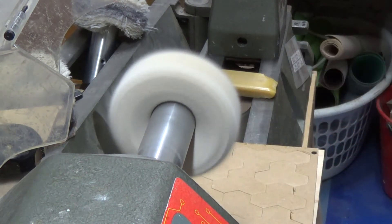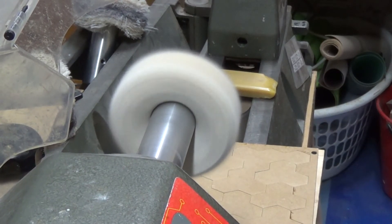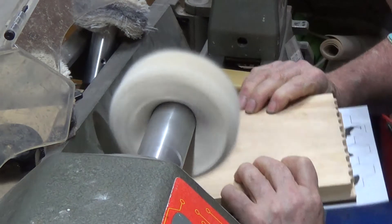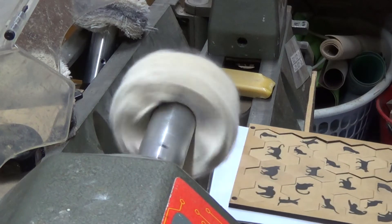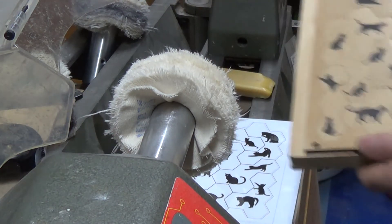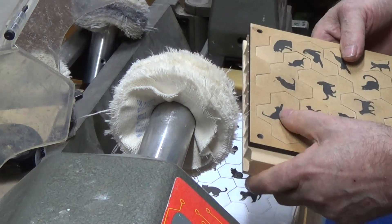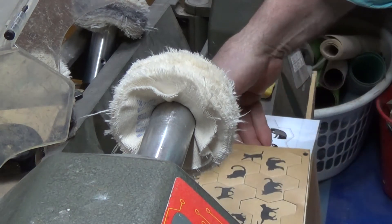Now I use this one only because I'm just too lazy to change the wheel, and for the wax this small wheel seems to be good enough. Give it a good coat of wax — this is carnauba wax — and you'll notice it's rather quick. I'm running this at the moment at 2000 revs; the other two ran at about 1400. It's a smaller wheel so it doesn't quite run as fast as a larger wheel. Naturally, the bigger the wheel the further distance the outer perimeter has to travel, so the outer part of the wheel will always travel faster than the smaller wheel.